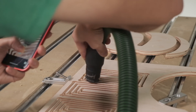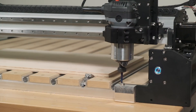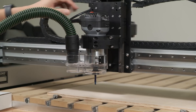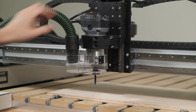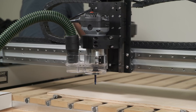And just because we can take such aggressive cuts doesn't mean we always should. There are some cases where maximizing depth of cut isn't good, namely in thin features like you saw with our first test. That cut was just too violent for the level of detail in that toolpath. In those cases, you can try reducing the depth of cut or feed rate, or reducing depth of cut and adding more feed rate. This is a balancing act that you're going to have to do based on your project.